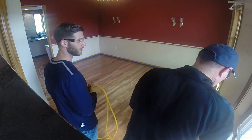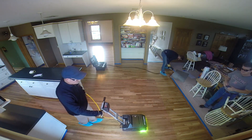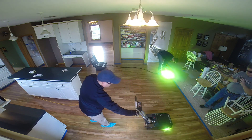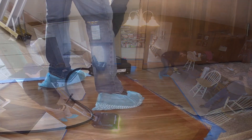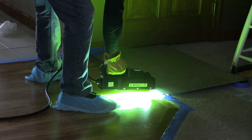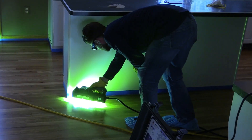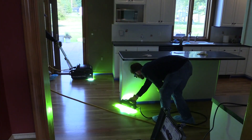While the Bulldog does a great job with the field of the floor, the Mako is used for the perimeter. We keep the Bulldog away from any transition areas such as linoleum, tile, and carpet, and use the Mako handheld edger for those areas. We use a metal plate to protect the carpet edge between the wood floor and the carpet. Upon completion of the UV curing process, take note of special areas under toe kicks, along cabinets, and transition areas to be sure all the Cure Guide technology in the finish has gone clear. If not, go back with the handheld unit and cure the finish.